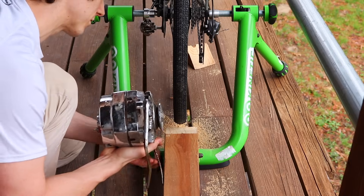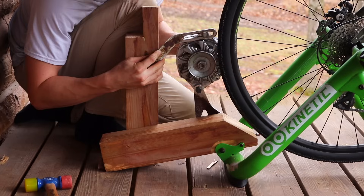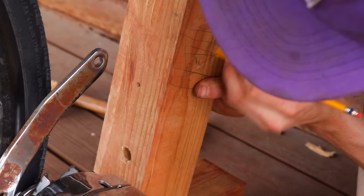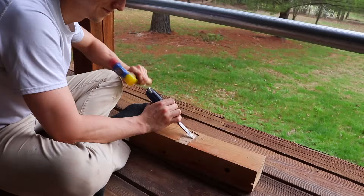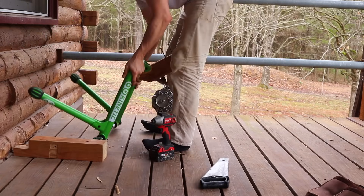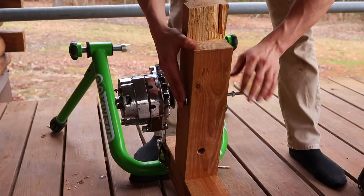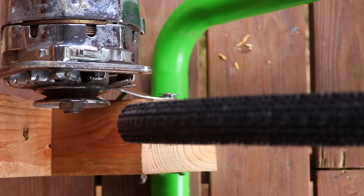With the bike in place, I was able to find the position the alternator needed to be at in order to make contact with the tire. A good thing about using an alternator is they tend to have brackets made to adjust the slack out of a belt already. So if you carve and arrange your 4x4 to accommodate these brackets, it ends up working very well in combination with the bike trainer. With the alternator's forward and back adjustment and the trainer's side to side adjustment, I had zero problems creating traction between the tire and the pulley.